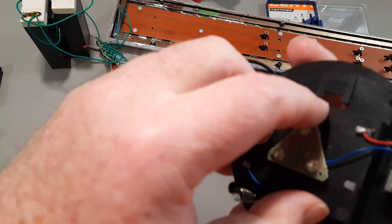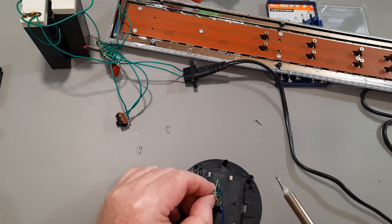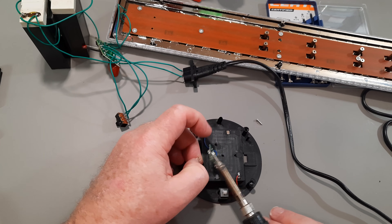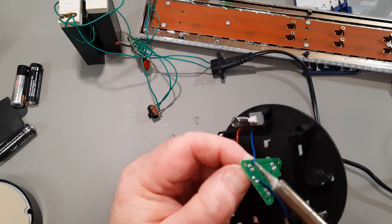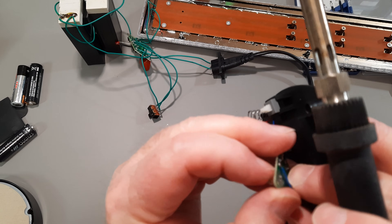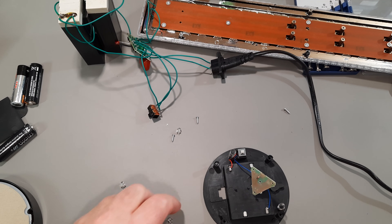Here it is — here's the underside. I had to snip this one. As you can see, not a lot there. So, to desolder these — make sure I get in focus, try to get the thumbnail underneath it, and I'm not kidding — just heat up both leads at the same time and pull it out. Times three. Here's the next one: heat up both sides and hopefully it'll just pull right off. There we go. And the last one. I probably should have put a bit more solder on it. There we go.